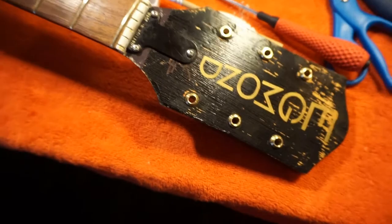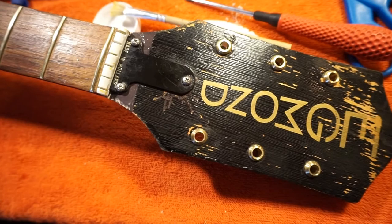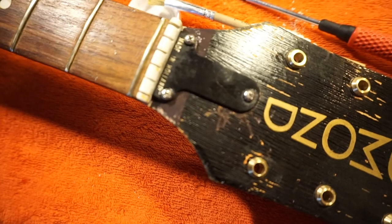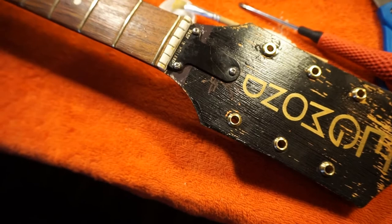Voila — made in Holland. I like to put a little soap on the threads before I screw it in, especially if I've filled the holes with glue and a toothpick. That way, in case the glue isn't quite dry yet, it won't stick to the screw so much. But really, screws go in easier, they come out easier, and they do less damage to the threads you're cutting into the wood.